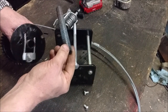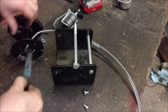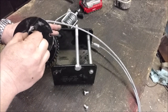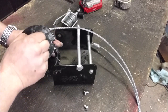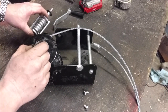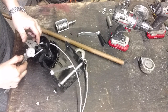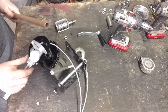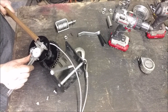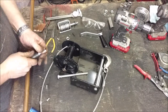Inside there's a tube that I got all greased up — that wedges itself so it can't move. But from the factory it comes with no grease, and you can see how much slop is in there. I want to build a shim to take out that slop. I measured the difference and got about 80 thousandths, so I need roughly 40 thousandths of material. This copper sheet happens to be very close to 40 thousandths, so that's my shim material.